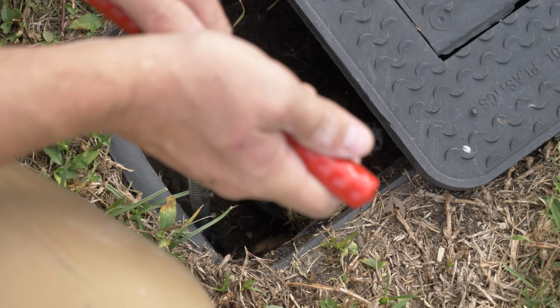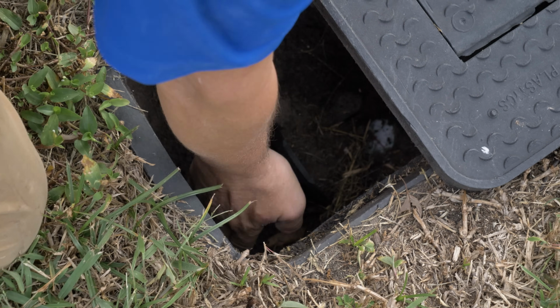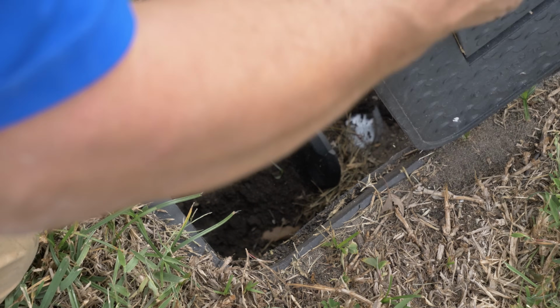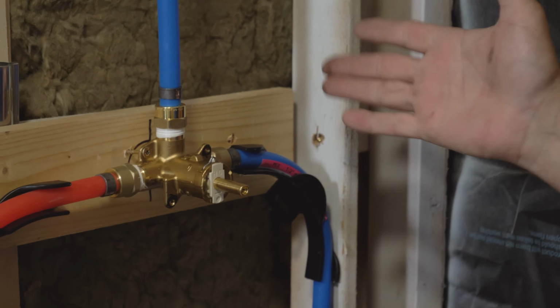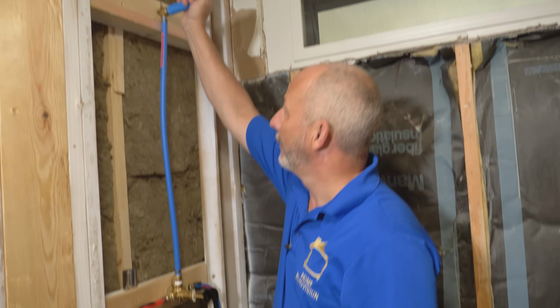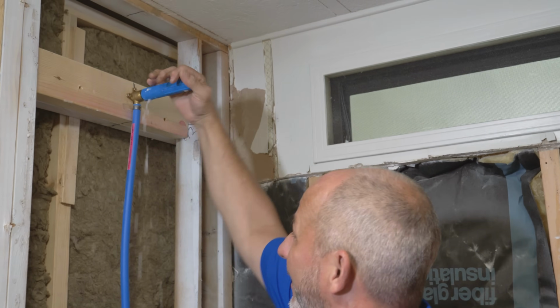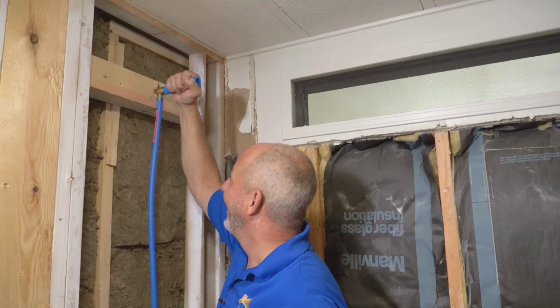Here we go again, back to turning the water on. Okay, there we go. Valve is pointing in the right direction. That's full open. Brilliant. Okay, so here we are, water pressure on the hot and the cold supply. If this is in the closed position, there is no water pressure in this line, so I can't test this yet. And the only way to check it is to slowly take this off. Yeah, here you go. You can hear it and you can feel it. There is definitely water in that line. This is not off. So, now we know.